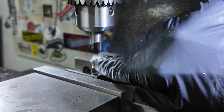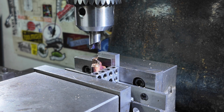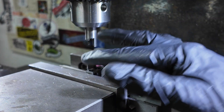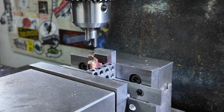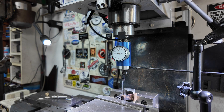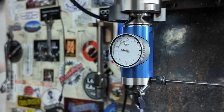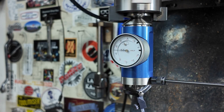We've made this little conical cutting tool and we're going to see if it works - just put a little bit in. It's pretty good. We've flipped the part and put it back in the vice and now we just need to centre up on this pin so we can clean up this other end. I've set up the coaxial indicator and we're pretty much right on the money. I've zeroed the DRO and we should be pretty good.